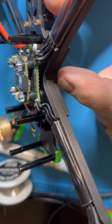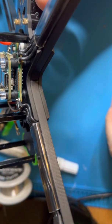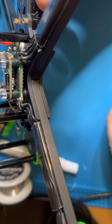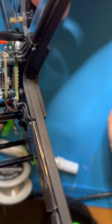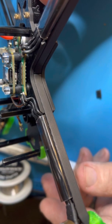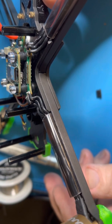There's a cutout in the panels for your connector — it's got a little rubber piece in there. There's also a cutout for your USB-C connector, and it's going to have to be perfectly lined up. The way you do that is by putting the gummies on the bottom of the ESC and then the gummies on the flight controller just like I've got them. They're different lengths — hopefully you can zoom in and see. I put the bigger side on one part and the smaller side on another. If it's not that exact height, you won't be able to use your side panel.